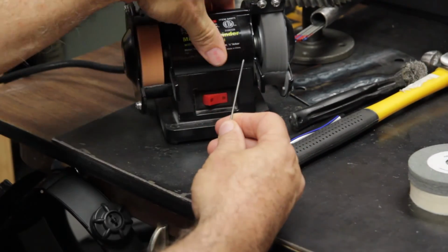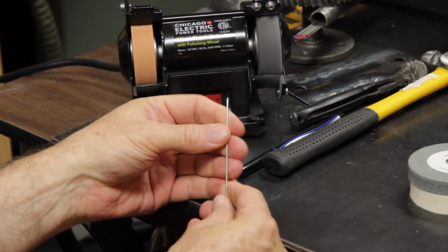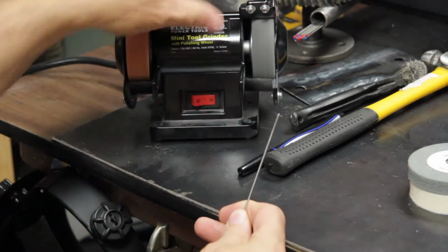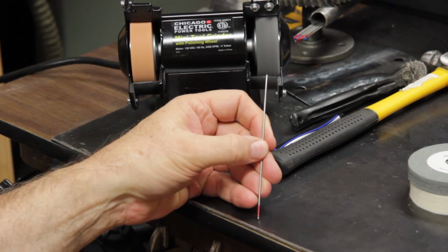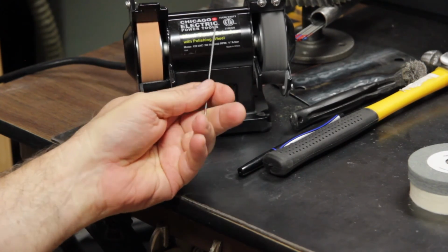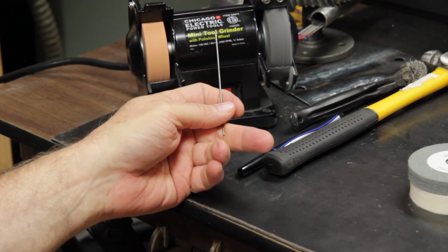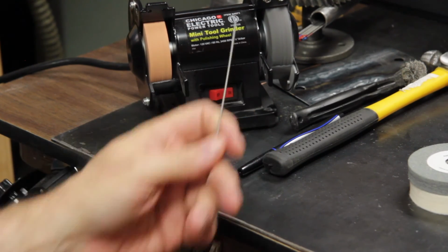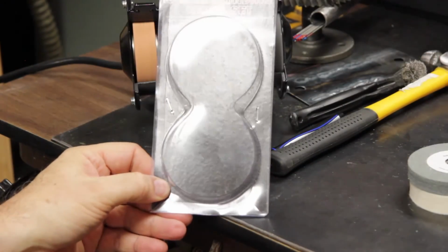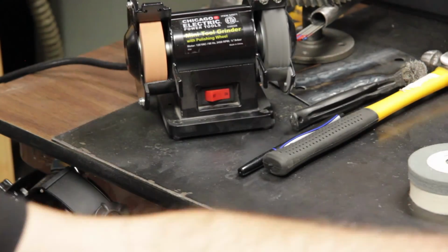I'm really enjoying having the luxury of the grinder right at my welding table, and I like the results of the polished tungsten electrode using the Scotch-Brite wheel. So just a couple of tips that I've picked up by playing around grinding tungsten myself. Again, the mini grinder is around $28, and if you use a 20% coupon, you're saving even more. Given the size and the cost, I can pick up the replacement grinding wheel and Scotch-Brite wheel at Harbor Freight. So I think it's a great deal.